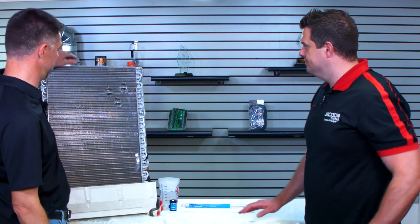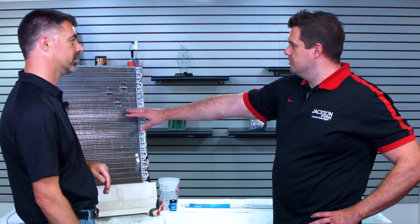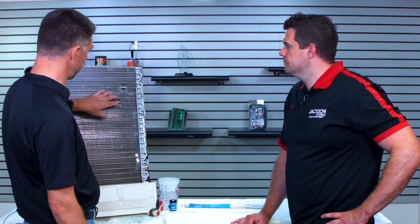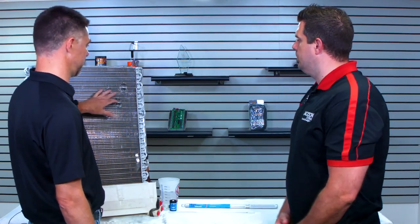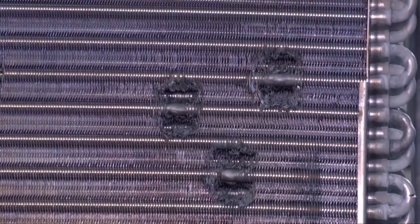So kind of describe what we've got here — I'm assuming this is the coil we're talking about. Absolutely. You can see a couple of other spots where we've done some repair practice in here. Now they look like giant holes, but these have actually been repaired. They are large holes, but this doesn't go all the way through the coil. It does very slightly reduce the efficiency of the coil because you're going to limit the airflow through this spot — but the alternative is it doesn't work at all. You can either have just a slight reduction in efficiency, maybe capacity — we're talking less than a percent — so a lot of systems can handle that type of issue.